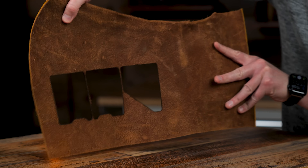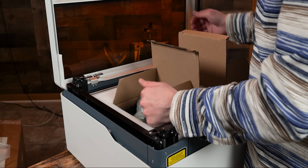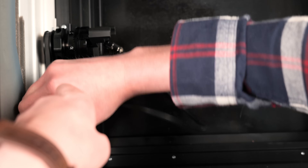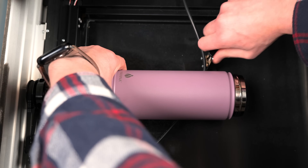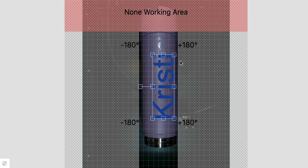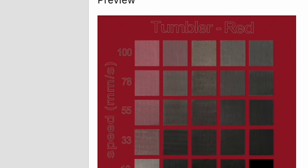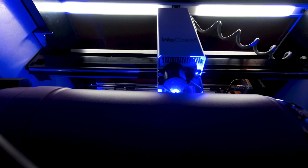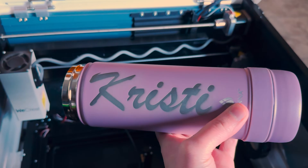Let's look at what a lot of people will want to do with this machine: engrave tumblers. If you opt for the rotary pack, you will receive a rotary set which includes a chuck, cylinder lift, and a few other parts. The chuck mounts on the left side frame with two screws and the install took about two minutes. I set up a purple tumbler by locking down the jaws and placed the roller lift underneath to ensure it was level. Inside the software, I typed out and enlarged a name across the engraving area, using a preset for a red powder coated tumbler. I have never had such an easy time engraving a tumbler — the camera is dead on accurate and I didn't have to play around with settings or align the tumbler perfectly straight.